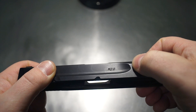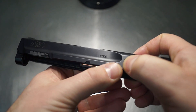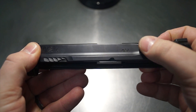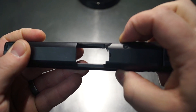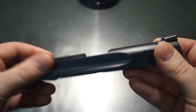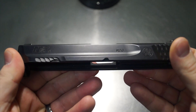We're going to be shaving these sides down. We're going to use a ball nose that's going to come right down through here. We're not going to hit this logo — it's going to come right through here, do a turn, and come right down this edge. We're also not going to hit the front grips or these little serration marks. That's going to get rid of this kind of weird cupped zone area on both sides, making it much more firm and square for your hands, so you'll get a better position, especially if you're cycling to the rear.